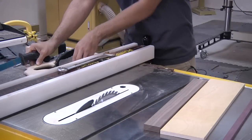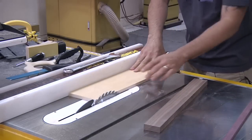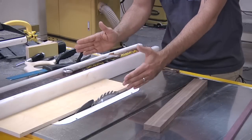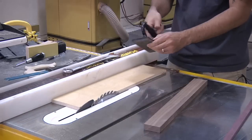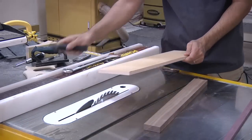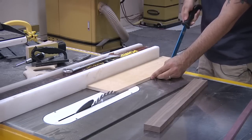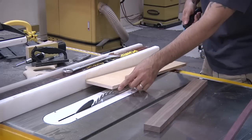First, let's start with this nice wide piece of ply. Something like this — by the time you're making this cut, you can use your hand but it gets a little close. Anytime we can keep our fingers away from the blade, the further they are, the safer it's going to be. That's the bottom line. If you use a push paddle here, that's certainly one option — not too bad for this particular situation. But if you use one of these skinny push sticks, that's bad news, because now we're pushing at the back of the work piece, and when you're pushing forward and down at the same time, the piece wants to flip up — and that's exactly what the blade wants to happen. That's how kickback starts.